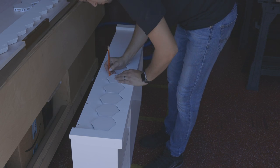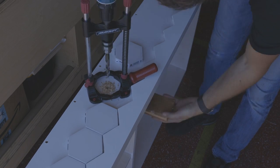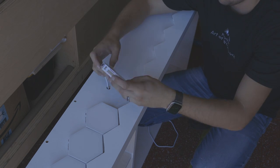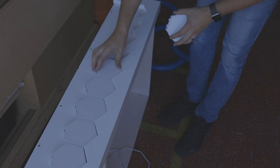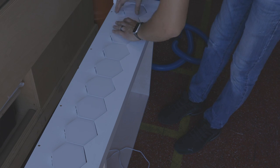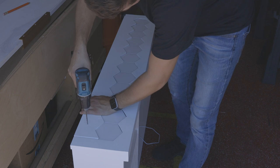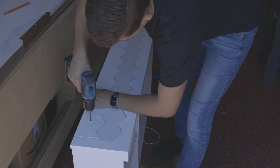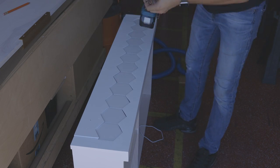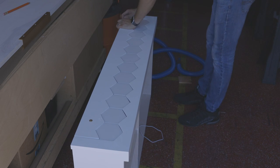Once the paint dried up, I'm moving forward and now I need to install the Helios touch hexagon lights. In the center I pre-drill an opening for the power cable, laying out the hexagons and securing them with another plank. This backboard can be taken off any time. I'm using flathead decorative screws and if I need to replace hexagons I can just unscrew them.